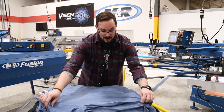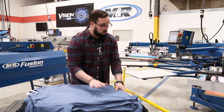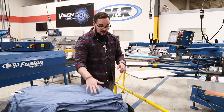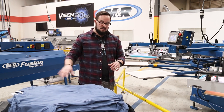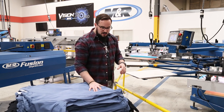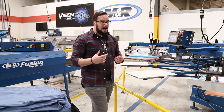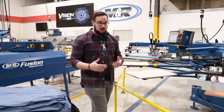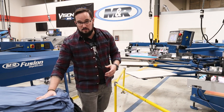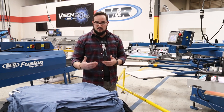I'm going to go over the way I was taught and still do most of the time — printing the front, so I'm working with the front side up. It's important to make sure your stack of t-shirts is nearby, whether on your right or left depending on where your dryer unload station is. Make sure you don't have it too far away — if you're doing 400 or 500 shirts per hour, hour over hour, day over day, week over week, having too many extra steps can start to cause body problems. We want to avoid extra motions and be as ergonomical as possible, which will also help with efficiency and speed.